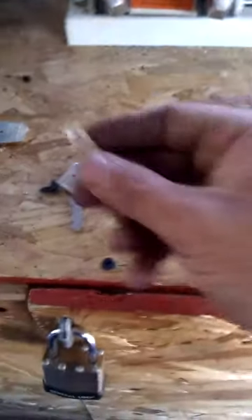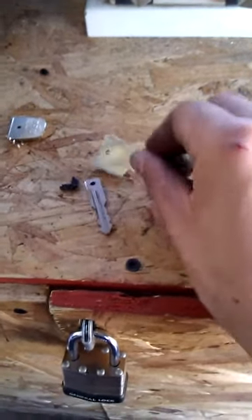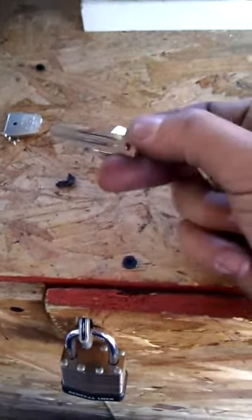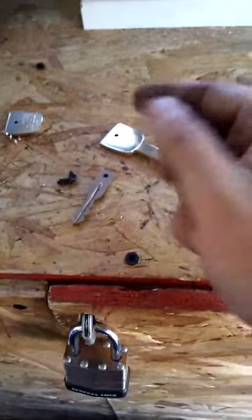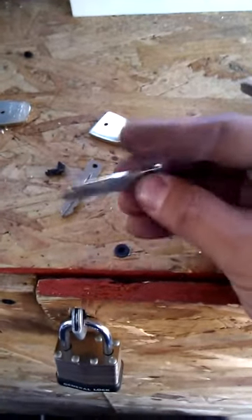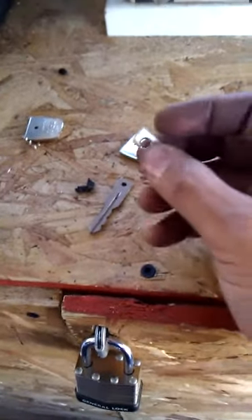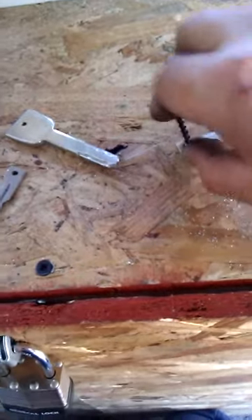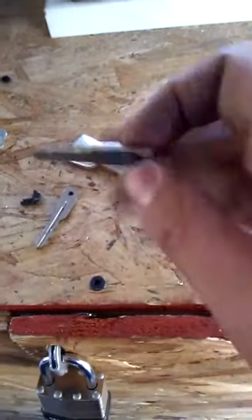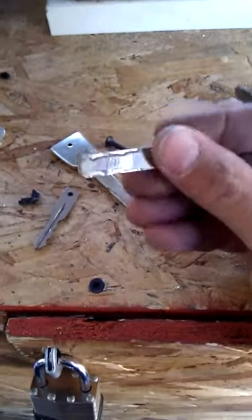Here's a good example right here. This is a test key and a great example of a surf key. But you can go even further — this one is off of an old Honda Accord. What I like to do is drill a little hole, chamfer it out so it's nice and smooth, and cut the head of the key off. It's just enough to fit into the lock. I've drilled a little hole in here so you can come in with a little screw or a Bic pen and put it through there if you need a little bit more leverage in turning.